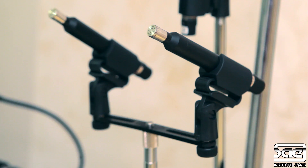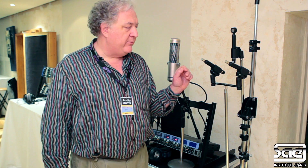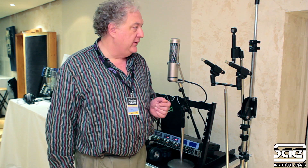Then we have what we consider to be a reference standard omnidirectional microphone. All of our microphones are condenser types powered by standard 48-volt phantom power. This one is also 48-volt phantom power, but it generates 200 volts for the microphone capsule. While the other capsules are plastic diaphragm condenser types that operate on 45 volts, these are instrumentation capsules from Microtech Gefell that operate at 200 volts, which is necessary for the best performance. We consider that's pretty much the best omnidirectional microphone that can be made today, and that's why this is the one capsule that we actually buy from someone else.